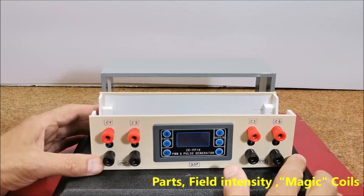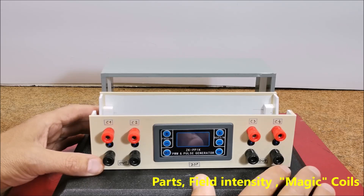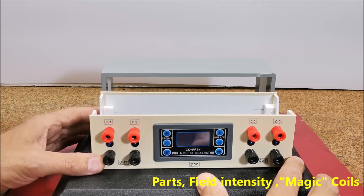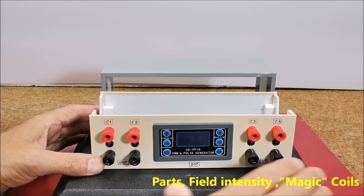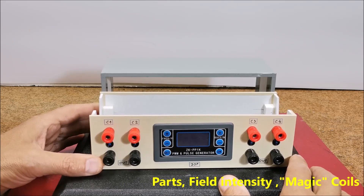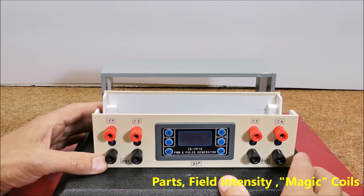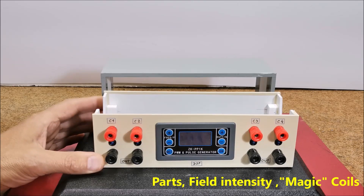I would like to suggest a very important note. Very often on my channel I receive requests for advice on how to make a PEMF device that would output a very strong magnetic flux of 200 Gauss and much more. According to NASA's extensive research in this therapeutic method, the best results are obtained at magnetic flux in the range of 0.1 to 4 Gauss. By increasing the strength of the flux the effect of the therapy remains unchanged, so the rule 'stronger magnetic field equals stronger therapy' does not apply here. In this device the magnetic flux strength is between 10 and 20 Gauss per channel, which is more than enough.